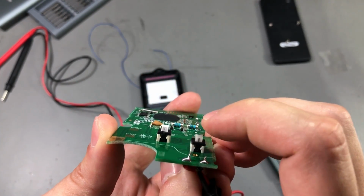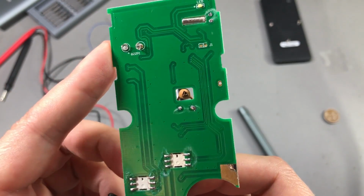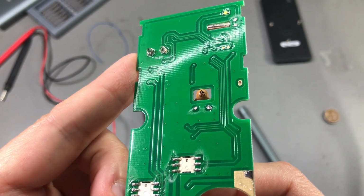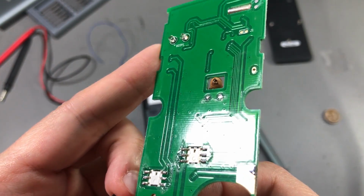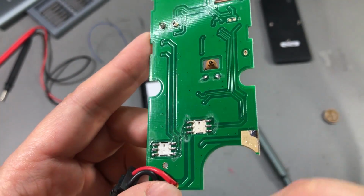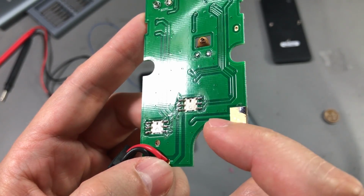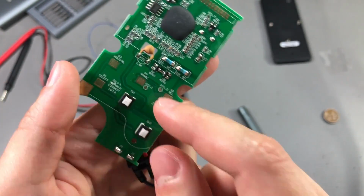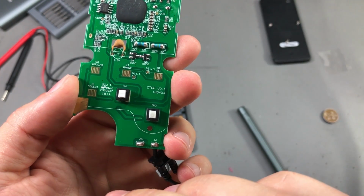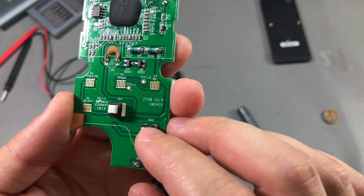Here are the two mechanical switches. They are very compact, and I'm not sure if they were really supposed to be mounted surface mount, or they were through hole, and you see they made this cutout in the PCB and then bent the terminals on the back of the PCB and soldered them. Maybe they are repurposing this, maybe they are through hole switches, I'm not sure.